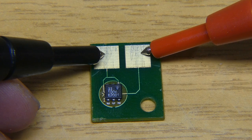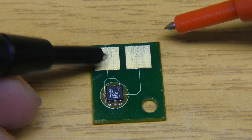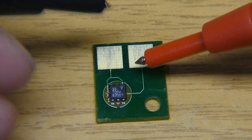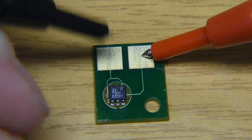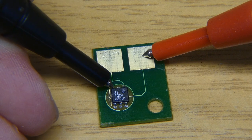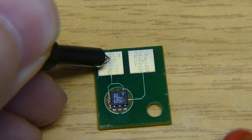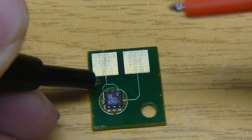And there is one well-known protocol which actually allows you to do this, which is called one wire, because it uses a single wire on top of ground to have data communication and power. It is then called parasitic power. If you also look at the pad, so if I short it, you would hear a beep. This pad only goes to pin 2, which is right here, and not to any other pin. This pad, you can see the trace, only goes to pin 1 and none of the other pins. So on pin 1 we have ground, on pin 2 we have data and VCC.